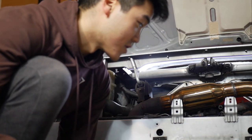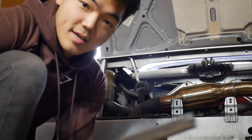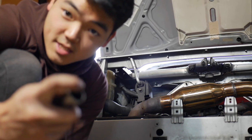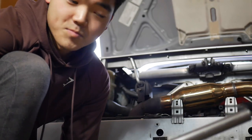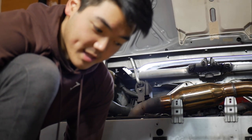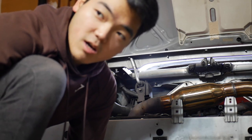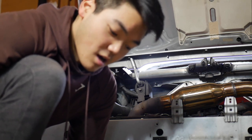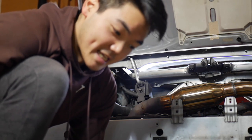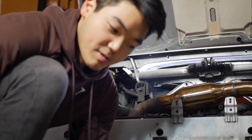So what I have here is three 36-inch by one-inch diameter, one-sixteenth-inch wall thickness steel tubes — that's how thick the metal is. These are plain steel, weldable steel. I was thinking galvanized steel, but galvanized steel has a zinc coating on top and it's really bad to weld — you're supposed to take off that coating before you weld. So I didn't want to make Kung breathe in those fumes and decided to just get normal steel.